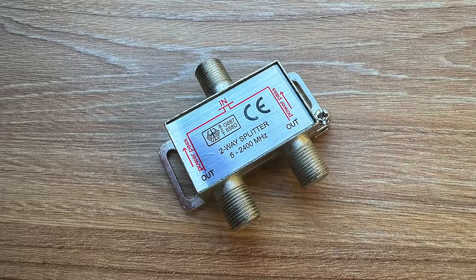Now if you want to plug in your satellite dish into the caravan, this modification that we've just done won't work, and there's a very simple reason for that. Let's take a closer look at the splitter we've just used. In the previous method, I used this splitter. If we look closely at the writing, you can see it has written on it: power pass on both sides. This means that any voltages that are present are passed between the inputs and the output.